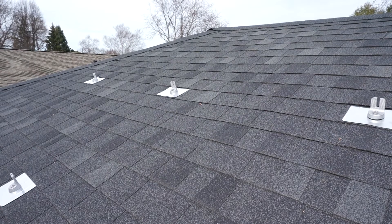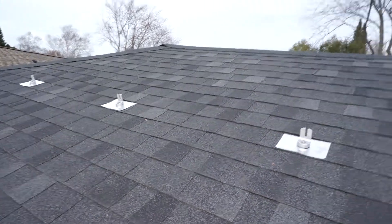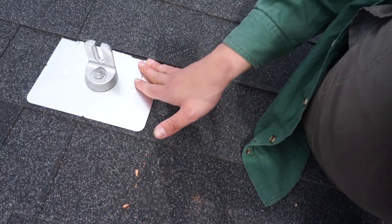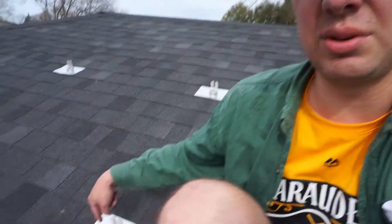I was never more than about three-quarters of an inch off. After that, using a pry bar, you pry underneath the shingles just to loosen up the glue — shingles have glue built in. I replaced this roof a couple years ago so I'm very familiar with the makeup. Basically you're just loosening the glue so you can slide the flashing right underneath the shingle to make sure it's all waterproof, then put a little sealant around it, a little sealant in the hole, and cinch it down with an impact driver.